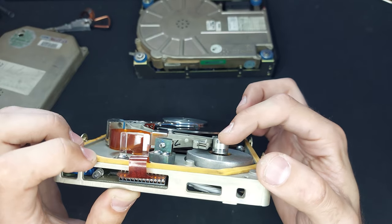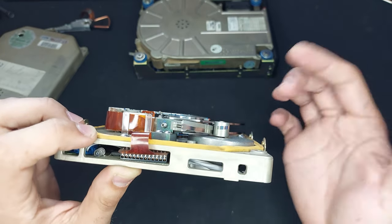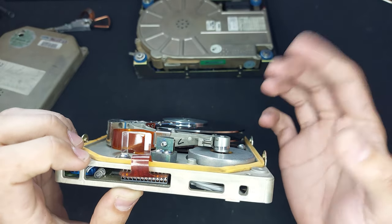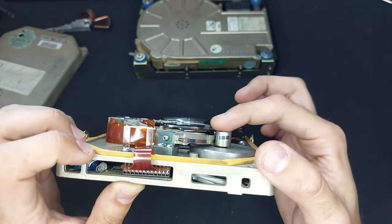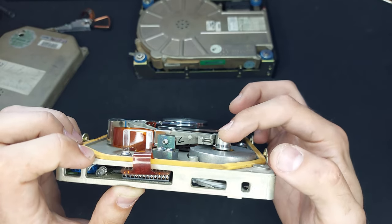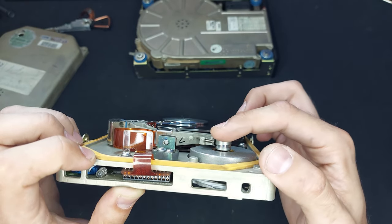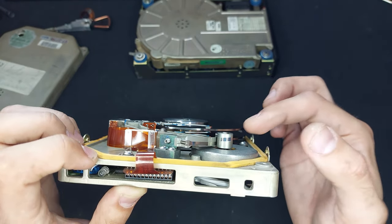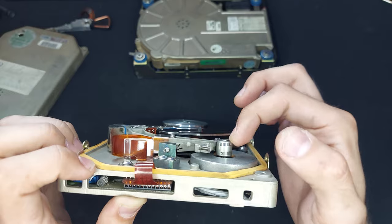This is also used, I think, in surface grinders, and there's almost no mechanical wear, so there's no pinion and rack to wear out. And a pinion and rack would have much more backlash. There's ways of managing backlash in gears as well. You can have anti-backlash gears. I think I'm going to try and link a thing in the description. But this is one of the cheapest and most reliable because it's just a very thin sheet of metal bending, and it's very repeatable and reliable.